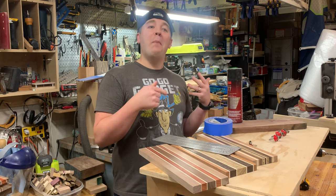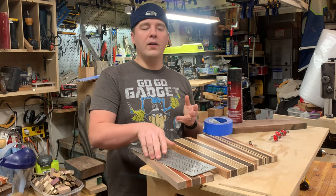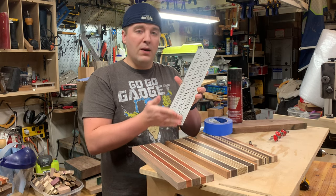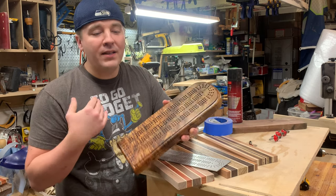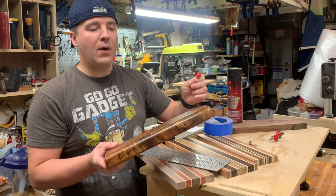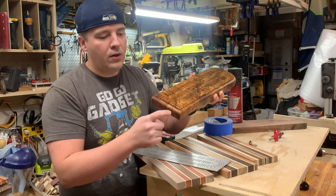The reason we have to go back is you need to know how wide your piece needs to be. You can see I've got a little bit of room on either side — it's really important to give yourself a little room. On this particular template it's a little bit narrow, so if you only make your piece just barely wide enough, you can run into issues. Here's one I made — my personal set a couple years ago. I had drilled all the holes and then I wanted to do a cool edge profile with a round over bit, and I kept going wanting a raised profile, and it just trimmed off half of my hole. The board still works and we still play with it, but it trimmed a little close on the end and also where you score.